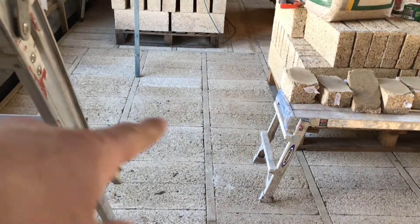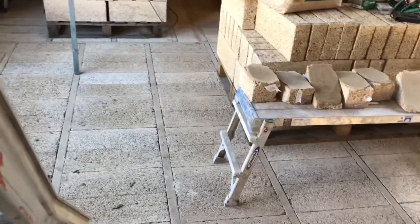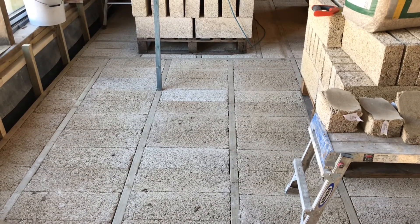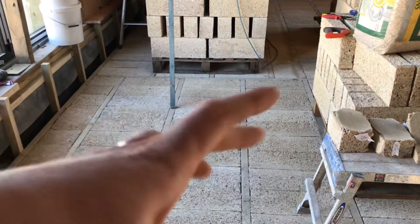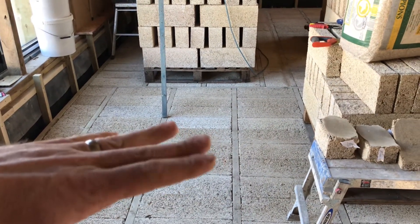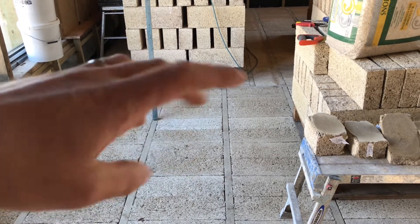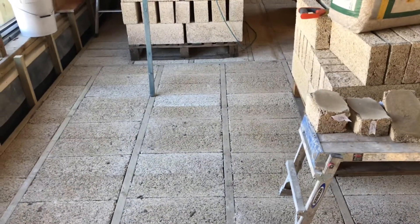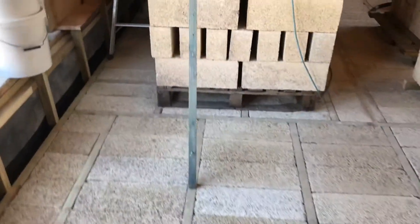The benefit of having the hemp blocks between the battens is that it's solid. My boards aren't tongue and groove — they're literally from a tree that fell down locally that I've had sawn up into planks, which will go across. If you don't have tongue and groove, the separate boards can flex when you walk on them. But with the solid hemp block insulation underneath, they're not going to do that, so I don't need to tongue and groove the boards, which is a massive bonus for me.